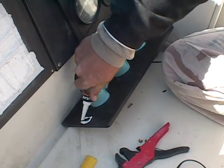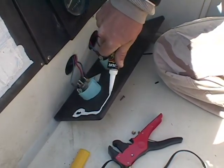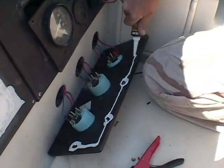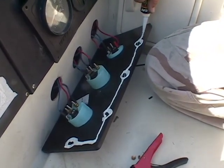Circles here, caulk so the screw holes don't have a leak, and then form the picture frame. It keeps the water from coming into the electronics. Water is going to find its way into everything. And this is kind of like forming its own gasket.